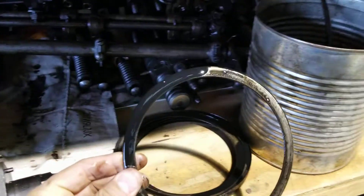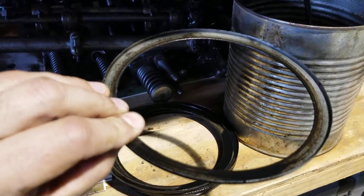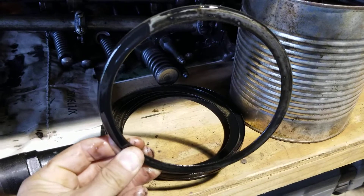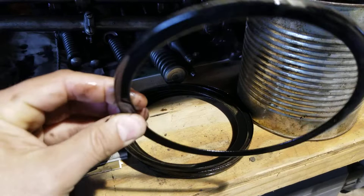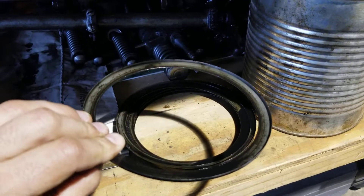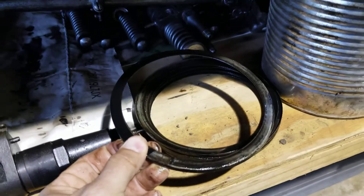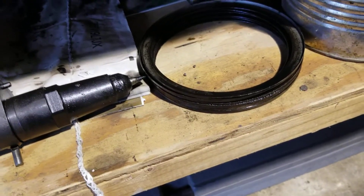These are what the Detroit Diesels use to seal each cylinder to the cylinder head. I don't know what's so special about these — they make them for every other engine except for the 6-1-10, but these things are like gold; they're really hard to find. Supposedly when you crush them once you can't reuse them, but why a guy couldn't have a thin copper shim made to fit and crush and be able to reuse these, I wouldn't know — they're just steel rings basically.